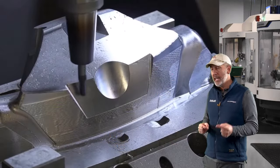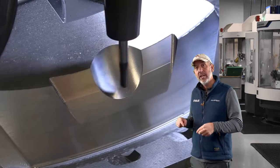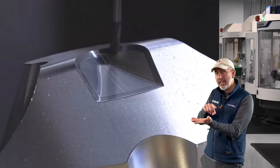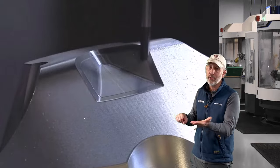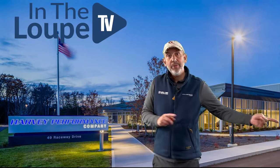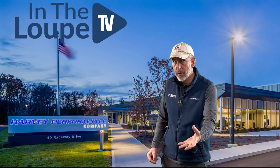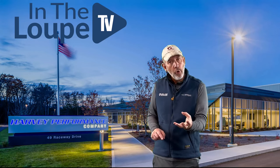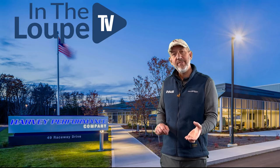That's how cusp height works. That's how scallop height works. That's how 3D surfacing actually works to create that surface. You can do this on all different surfaces — you could even do it on a straight line. Even if you wanted a really nice finish on a floor and your end mill wasn't achieving it, you can use a ball nose by controlling your radial step over and controlling the diameter of your ball nose. Scallop height, 3D surfacing — all around ball nose. Hopefully you now understand scallop height, which is what's achieving your finish.